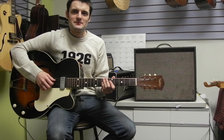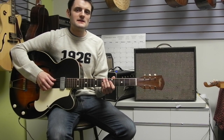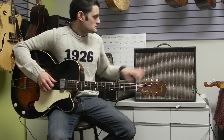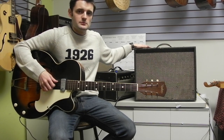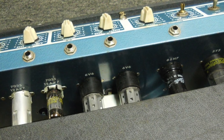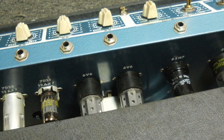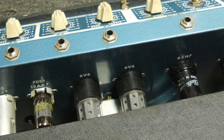Hi, I'm Jesse, and today we're here to look at a vintage 1960s Harmony H306A Guitar Combo Amplifier. This amplifier has a one 12-inch speaker layout and has all-tube circuitry. The tubes are two 12AX7s for the preamp, two 6V6s as power tubes, the tremolo is run from a 6SH7, and the rectifier is a 5Y3 tube.